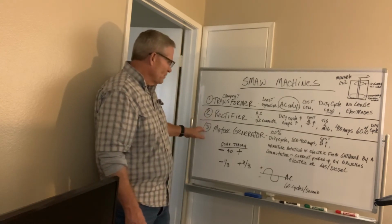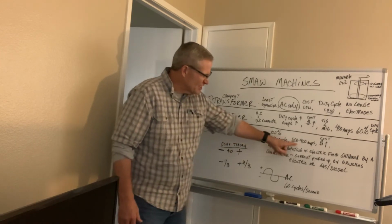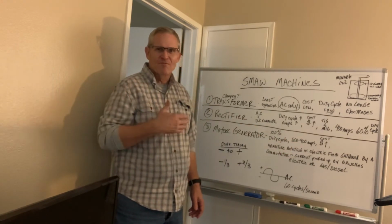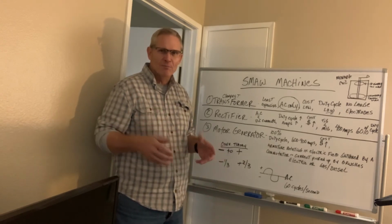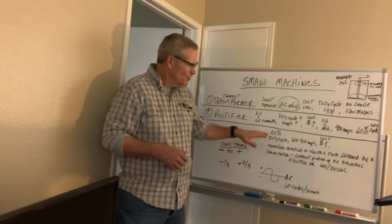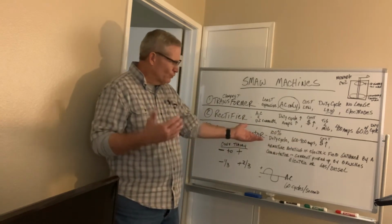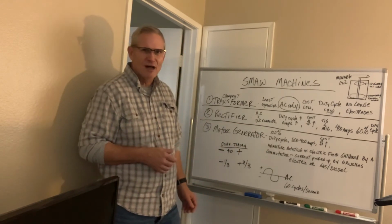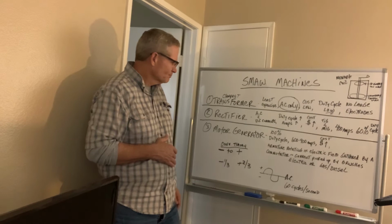Okay, so when you move into the motor generators, you're looking at 100% duty cycle, 600 to 900 amps. All right, so now we're way up on the scale. You can fairly much weld whatever you want. You can certainly air arc. When you get into the air arcing process, where you're air arcing a weld with the air or carbon arc process, you need these extra amps for that process. So that's where these motor generators would really come into play. And of course, the cost is up there, folks. You're looking at $5,000 to $6,000 if you want to get a brand new and really nice machine.